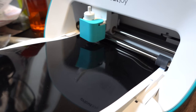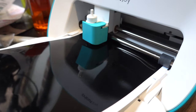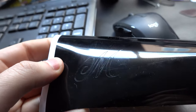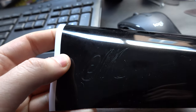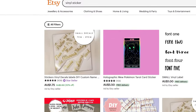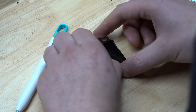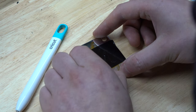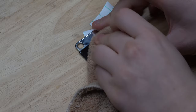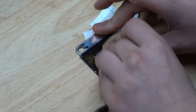The first thing we need to do is make a template for our etching. I've cut my logo out on some adhesive vinyl. If you don't have access to a vinyl cutter, there are plenty of people who can do this inexpensively - I've seen hundreds of people offering this service on Etsy for a very reasonable price. The template must be waterproof - remember, any part of the metal that is exposed will be etched. With my design I want the M logo to be etched, so I'm going to apply my vinyl to the plate and then remove the M logo from the vinyl.